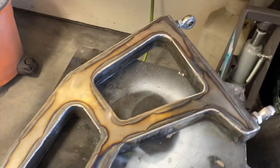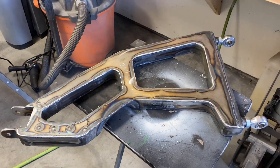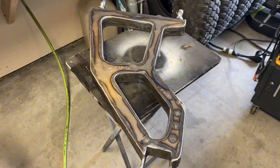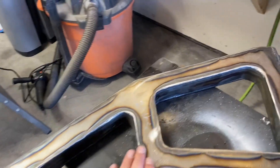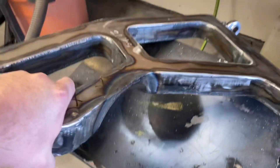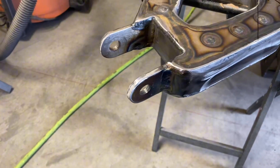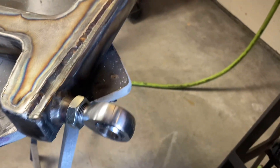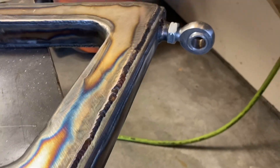We need to build another one of these. This is the left side upper A-arm. So far I only have one, so I need to build another one. I've got to first build a jig off this one so that they're exactly the same. Then I've got to do a plasma cut — these upper plates, lower plates — and start to get it jigged up, cut out these brackets here, and finish up this back tube where the heim joints might mount up. So we'll get that going.